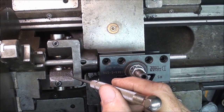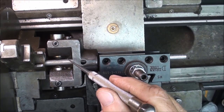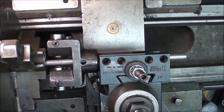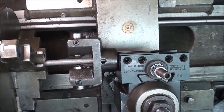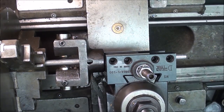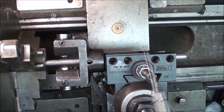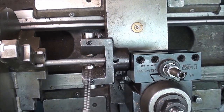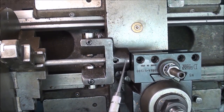So anyway, in this close-up here, one thing that I didn't mention is that this type of knurler allows you to make very long knurls as well. Can you see the end of the work out here? In fact, when this is mounted in a turret lathe, the work can be as long as desired within the limits of that machine and how deep the turret allows the stock to travel. And that's why they put a hole all the way through these knurlers like that.